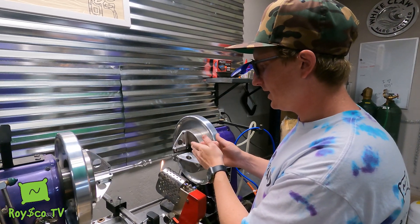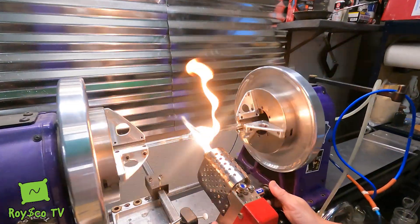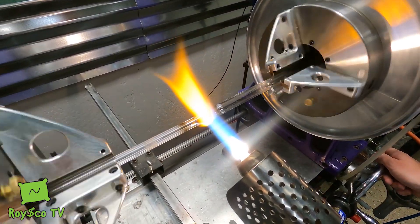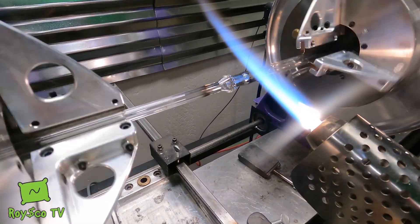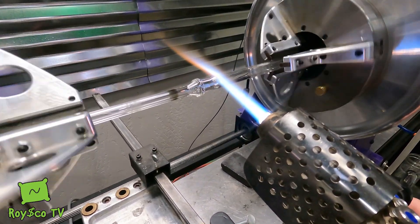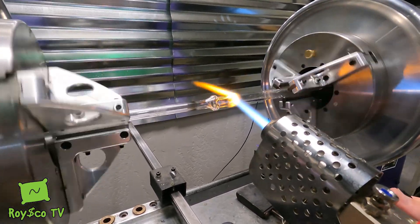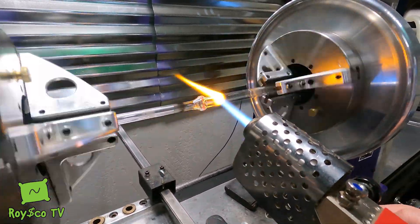Now we have the joint over here on the right side of the lathe and a blow tube hooked up on the left side that's been flared out to the same size as the top of the joint. I'm just going to do a quick cold seal right here — it's a great way to hold on to the glass. I don't do a proper seal to where it would stay strong forever. This should be able to crack off whenever I want it to, which makes it very convenient for attaching this joint because it holds onto it great. But when I want to take it off it comes right off and I have the joint left on the piece. Pretty convenient technique — but you can also use a joint, plug it in there, maybe use some graphite tape to keep it nice and snug. That's pretty useful. But for this one: quick, easy, cold seal.